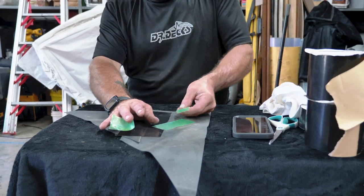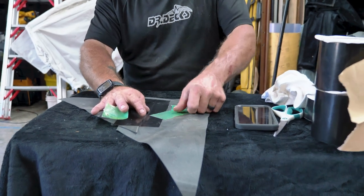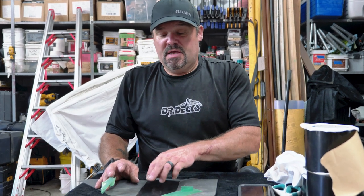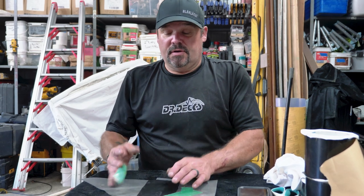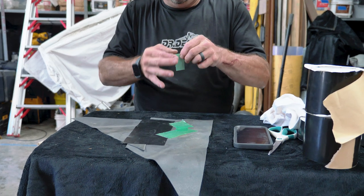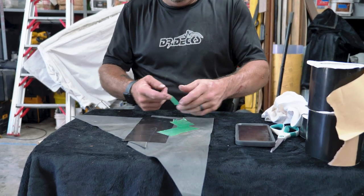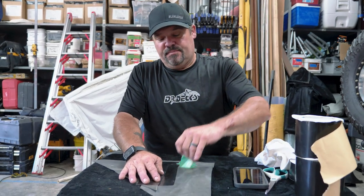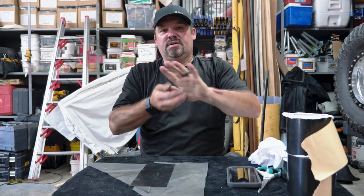The 1009 GR doesn't tack as hard as the 3040 series or 3035. It's not meant for waterproofing or UV protection — the 3040 and 3035 are heavy-duty, built for UV protection and long-term durability. The 1009 GR is more of a disposable masking tape. It works great for detail work around gutters, door jambs, and funky curves or circles. Once you're done detailing with your caulk, you just peel it up, it comes off cleanly, and doesn't really stick to your hands.